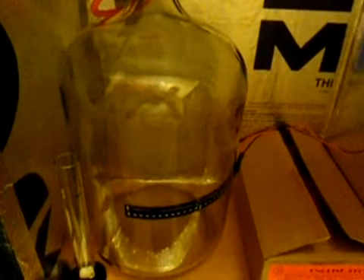And inside there's a bilge pump in there that circulates the cold antifreeze. And these 120mm PC fans circulate the air, and it does a pretty good job cooling down the temperature. I decided to build this because of the random heat waves that we tend to have in Southern California — makes it hard to ferment and keep the temperature that you need to keep.